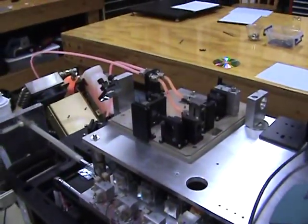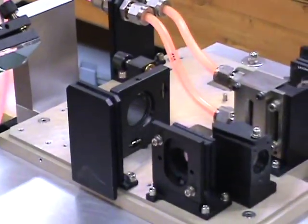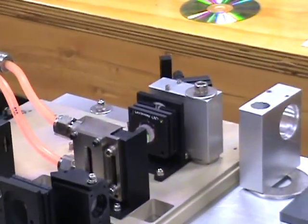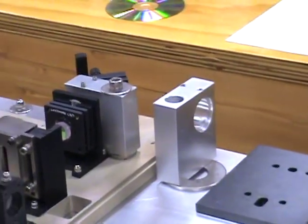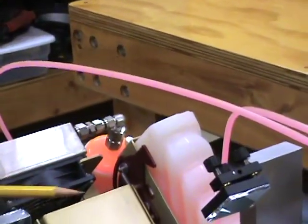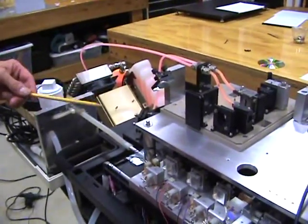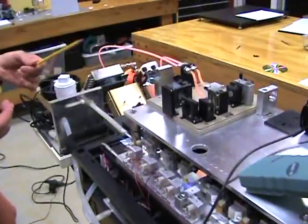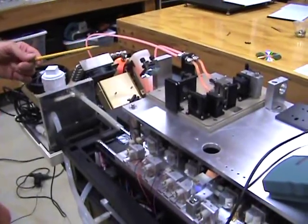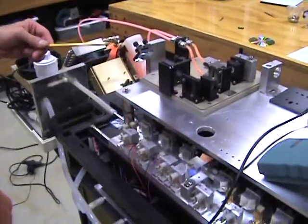It's large in diameter and has a relatively high divergence. But in their attempt to produce the highest conversion from the 1064 fundamental to the 532 output wavelength, the designers incorporated a Q-switch option, which produces a rapid train of very high peak power pulses, enhancing the conversion from 1064 to 532. It also increases the average output about 4 to 5 times, but increases the peak power 300 times more than that. So it makes it an excellent source for pumping a dye laser, which requires very high peak power.